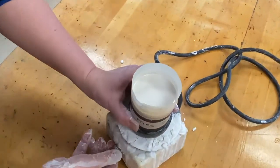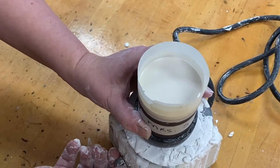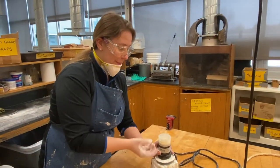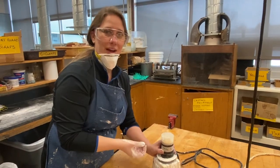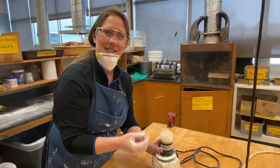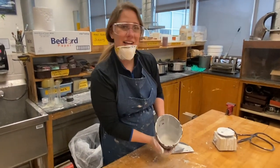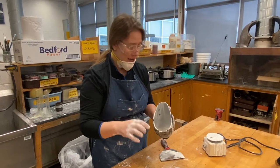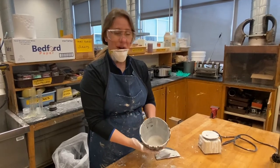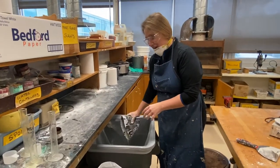After one minute I turn the vibrator down slightly. I can see there aren't many air bubbles, but I want to leave the vibration on for at least two minutes to get all bubbles away from my piece. If a bubble attaches to the side of the piece, metal will fill that spot and alter your final model. If I have extra investment, it could fill another small flask, but if nobody else needs it I'll dump it into the garbage and wash my rubber bowl.